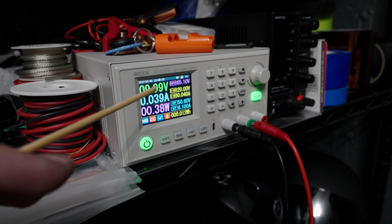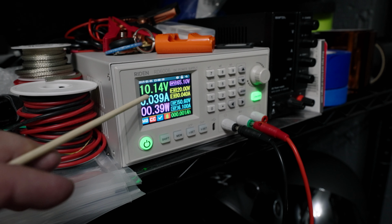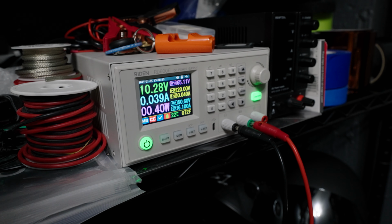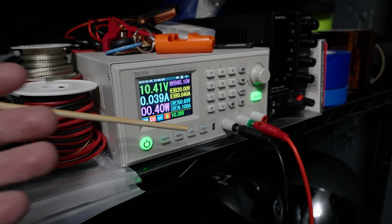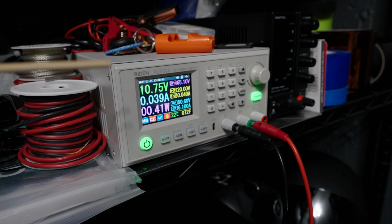relatively quickly, I believe once it starts to near about 18 or so volts, this will slow, because it is that point when you reach around 2.8 volts-ish or 2.5 volts per cell that most of the energy accumulation begins to happen in the cell. So down at this voltage range, the cells don't have a lot of stored energy. It's why a cell can drop from 2.8 all the way down to 1 volt or less very, very quickly with very little drain from a device. It's why it makes this sort of scenario, unfortunately, more common than we would like it to be.